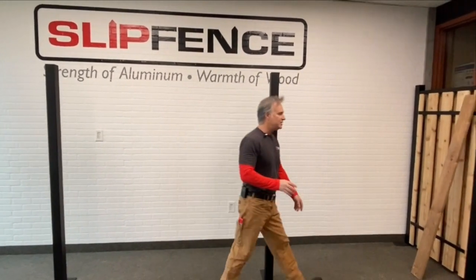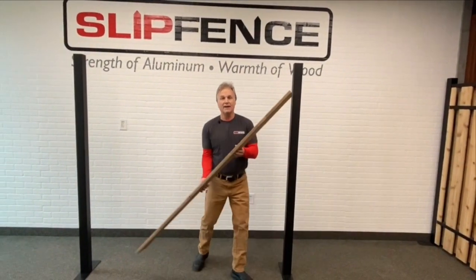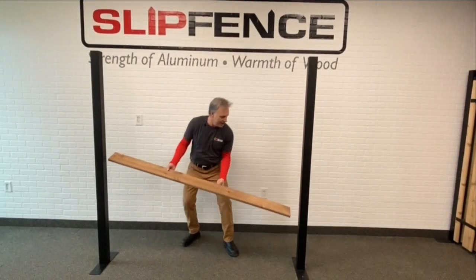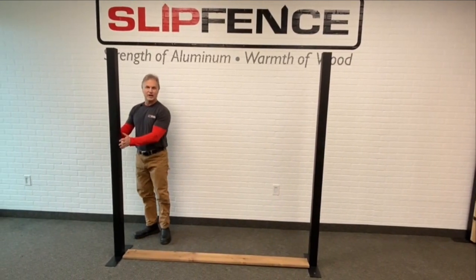The way that we do this is we typically cut one of your deck boards that you're going to be using in the horizontal fence anyway, and this will give you a perfect spacer. So once this post is in the concrete and starting to dry, you put your 6 foot piece of wood onto the ground and this gives you the spacing for your next post to set.